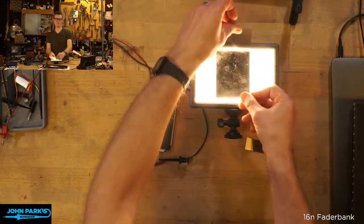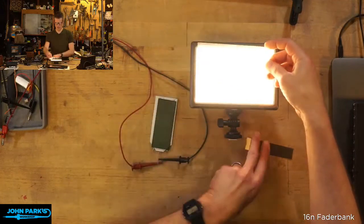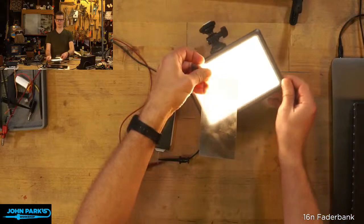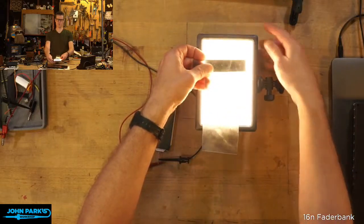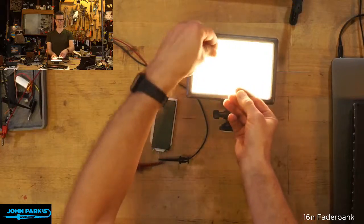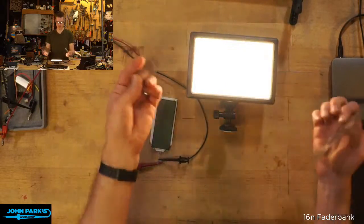And so that's the effect that's happening, there's a rotating disc that's causing that LCARS panel to receive light in some of its slots or not. And if you hold up two pieces right here, you'll see that sort of stacking effect, which is how that animation allows it to sort of travel through multiple sections of the interface. I don't know if they also use a circular polarizer. You can introduce a third polarization angle, and so there are neat tricks you can do if you use a third polarization and circular polarizers.